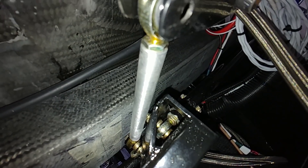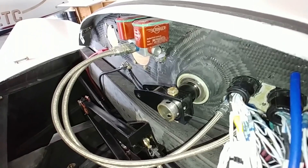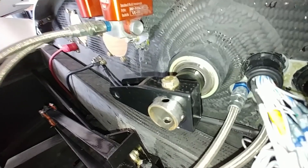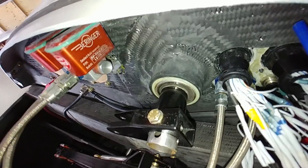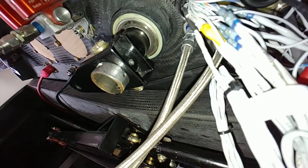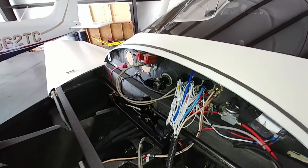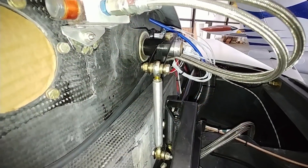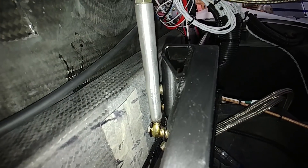These little jobs just take several hours sometimes because of the messing around and trying to get access to things. It's bolted in place there now and I've just got to redrill the hole in there. I also have to shorten that spacer, repaint it, and then that hole has to be redrilled back through the main shaft so I can put the cherry rivet back in there just to secure it even more. But the way I drilled that hole, the bolt is super snug — there's no play at all.